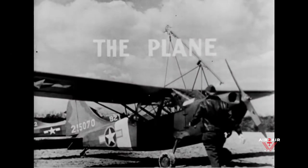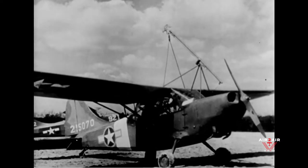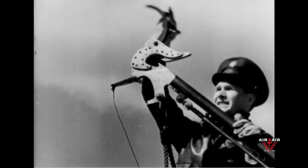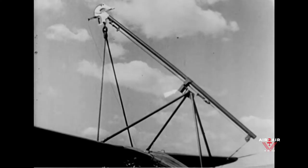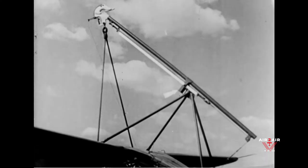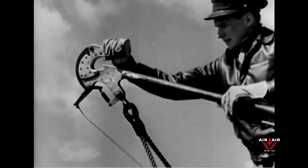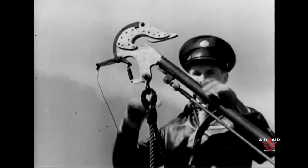All the equipment the plane needs is a hook which is bolted onto the fuselage. The takeoff release on the back of the hook has been shown, the finger and the trip. As for the landing, the arm is fastened onto a swivel joint. Running under the length of the arm is a bungee shock absorber, permitting the arm to bend down. The hook itself is fitted into the telescoping tube of the arm. The swivel, the bungee shock absorber, the telescoping mechanism, all three, take up the shock of the impact when the plane hits the landing sling.